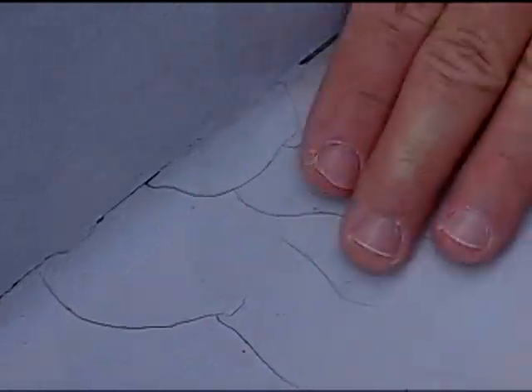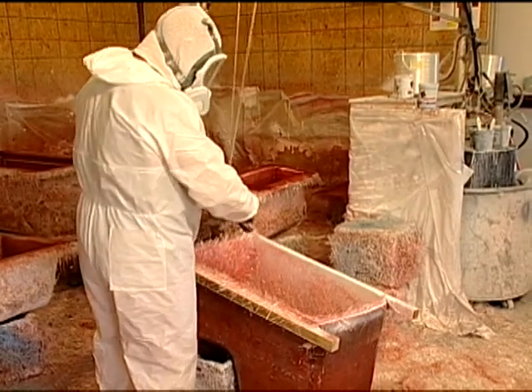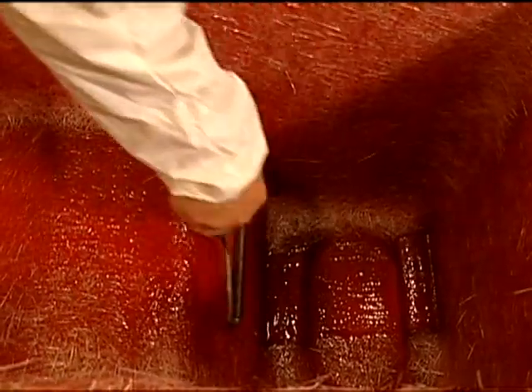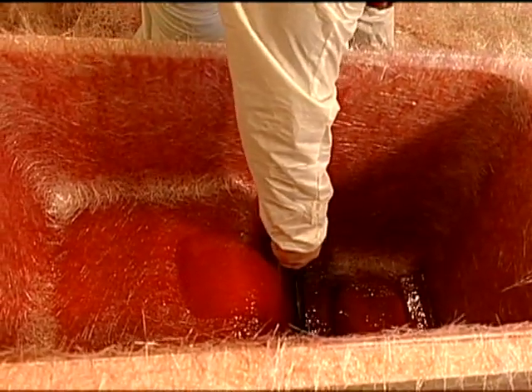Once the gel coat is cured, we're going to skin it using this awesome tool called a chopper gun. That's fiberglass chop strand mat along with the resin — you spray it in there. Does it have to get rolled out? Yeah, whether you're using cloth or chopping it like we do, always roll out the air. This job we're going to do in three sections. The first one is always called a skin coat — get that done and let it dry.